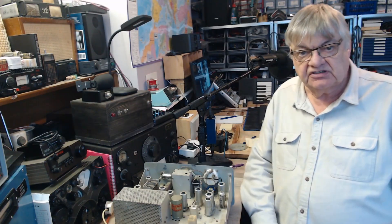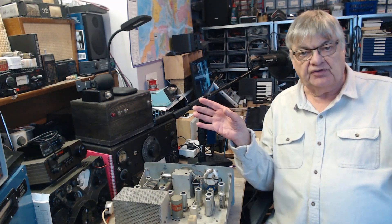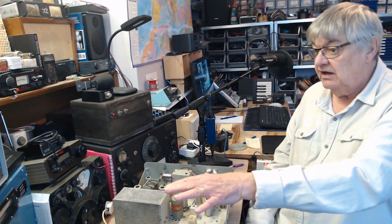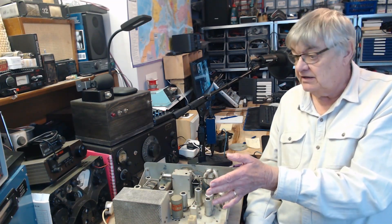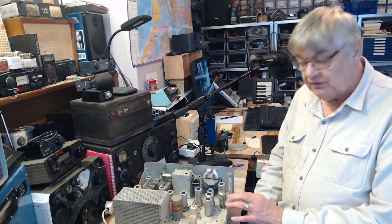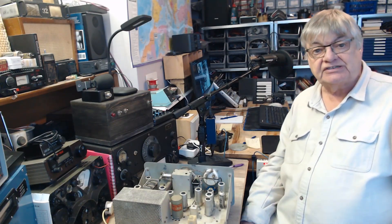Have a look online — look up 'un-un' and you'll find how to make one. If you don't want to make one, go on eBay and look up 'un-un' and you can buy one. Of course if you're into serious shortwave listening and serious DX, you'd want a proper dipole for the band you're interested in, or some sort of multi-band aerial, or the ATU as I mentioned. But that's just giving you a rough idea for general coverage. I also use a mini-whip active antenna — it's nice to have the end-fed wire as well just for general coverage. I shall leave it there. Thanks for watching, as always — bye-bye for now.